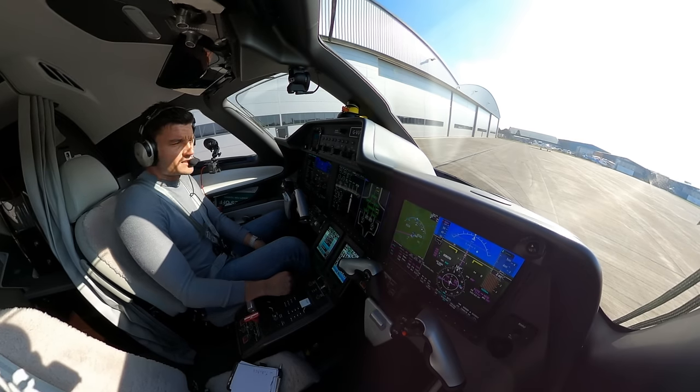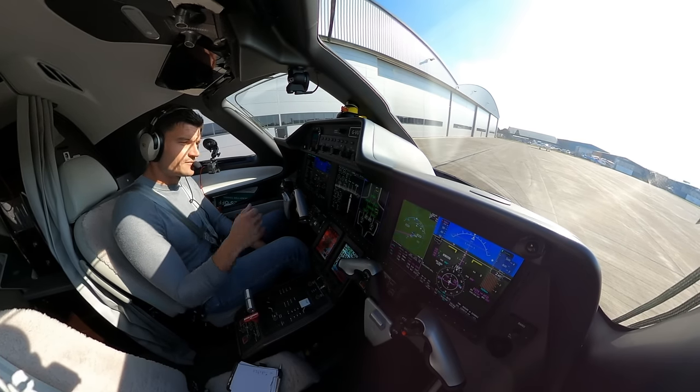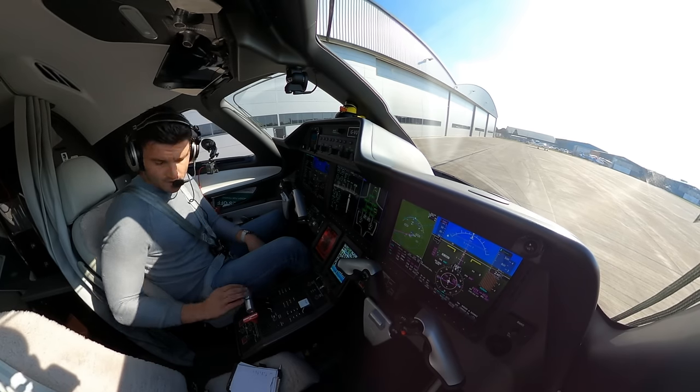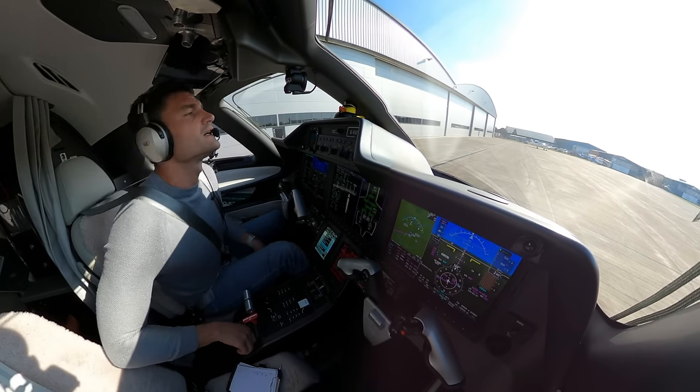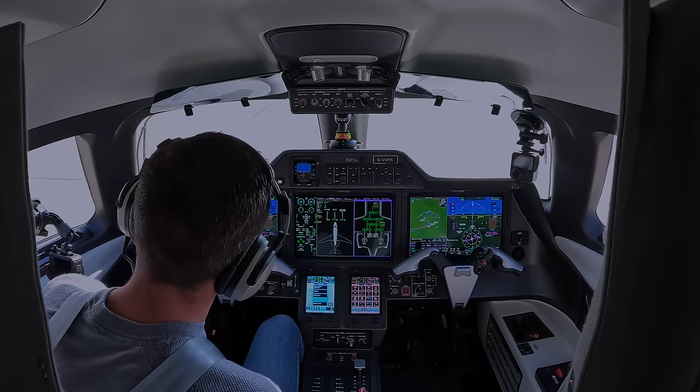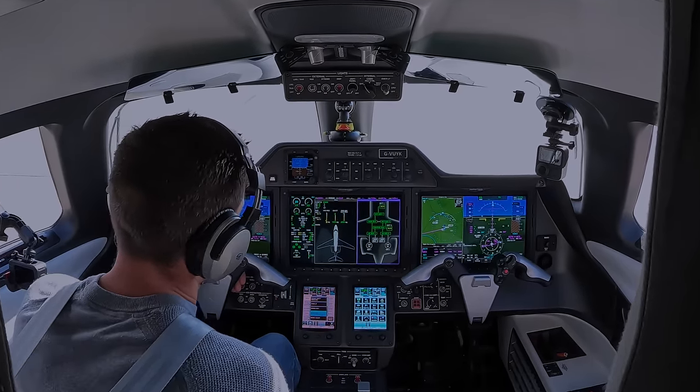Right, okay, so we're going to start engine number 2, the voltage is above 24, we have got a tailwind and it's a battery start, so we just need to keep a good eye on the ITT. So, aircraft is clear on the right, there's no marshaller, and clear on the left. So, on to run initially, and clocks are running, start.